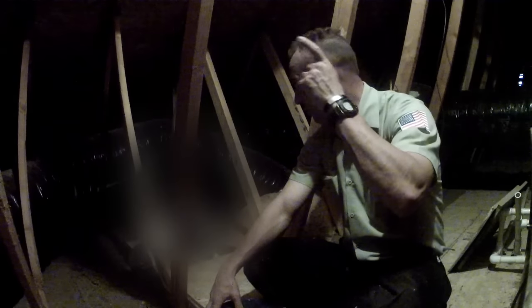It seemed to be in the past that on the nights when it was extra cold, I'm trying to find out what. That makes sense. But she doesn't change the temperature. She lets it sit. But what's the variable? The extra cold night. So the attic would be colder. Correct. The furnace is in the attic. Colder night. The control board's in the attic. So how much does a new control board cost? How sure are you that is a problem? I am 95% sure that that's the problem.